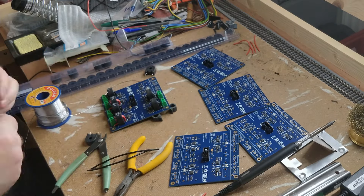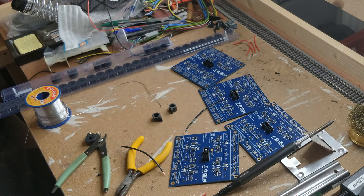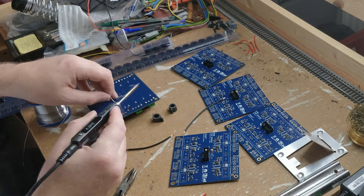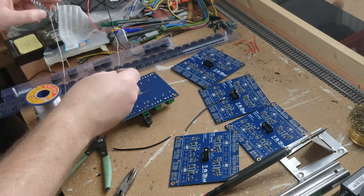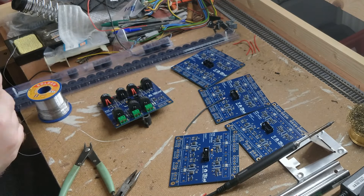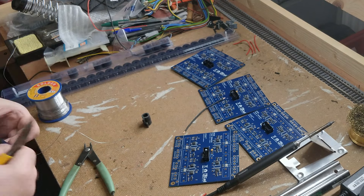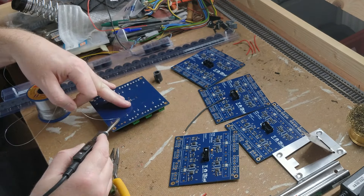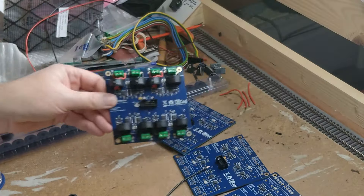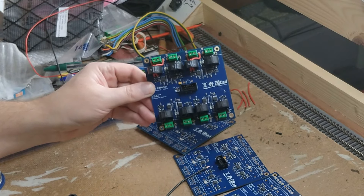Once I've wound and fitted all of these transformer coils, there's one final through-hole component left to add: a 1N5819 diode used for reverse current protection. We only added this because there's a spot for an optional power supply smoothing capacitor, and if you get a surface mount version of that, it would typically be a tantalum capacitor. Accidentally reversing the input voltage on a tantalum will give you an instant and slightly explosive failure. But without a smoothing capacitor fitted, there's really no desperate need for reverse current protection, and it could be replaced with a wire link. There's also a through-hole footprint for an electrolytic capacitor, handy if you find you need a power smoothing capacitor and didn't fit the surface mount one originally, or to replace it if it breaks and you don't fancy hand soldering a surface mount replacement. I do have the surface mount smoothing capacitor fitted in this case, so I'm going to dig out a 1N5819 for this diode.